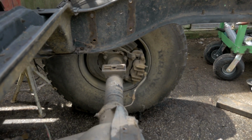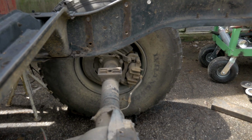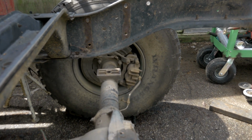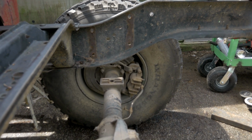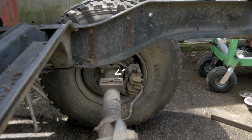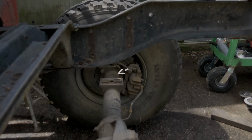I mean, they run full-size competition rock bouncers all the time. They're incredible at what they do. And his advice is always to stick that lower link as far on the outside of the axle as possible to provide enough stability going left and right. So when you see me putting those on at the furthest point possible on that axle, that's my reasoning.